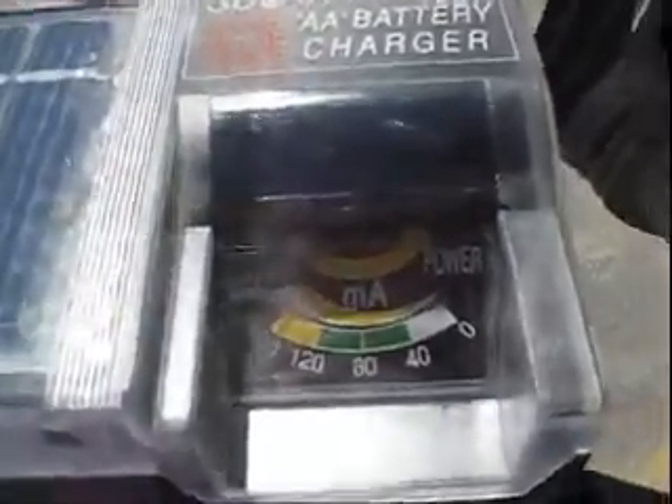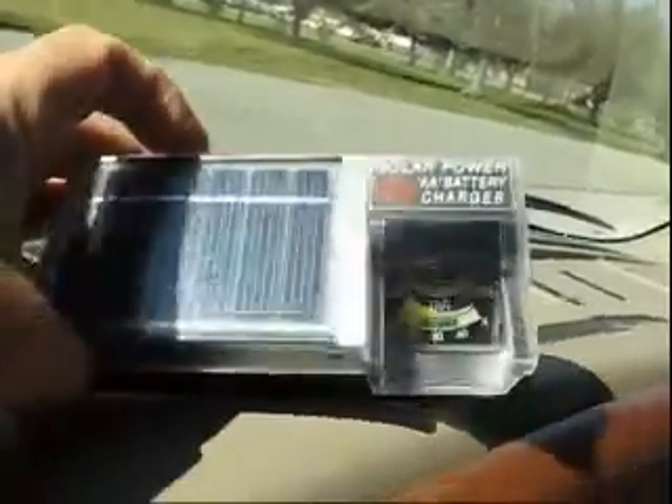One note I will have to make: I had gotten it and thought I could use it from my dashboard. But what happens is that, as you can see in direct sunlight, we've got 160 milliamps. But the minute your windshield is involved, it cuts it down to about 40 to 60, depending. The windshield has UV protection, so as you can see I'm moving it up and down — where it's not hitting the window versus where it is. So on the dashboard anywhere near the windshield, I'm not going to get as much milliamp power.